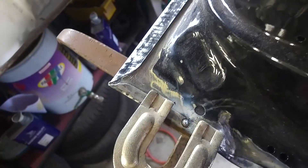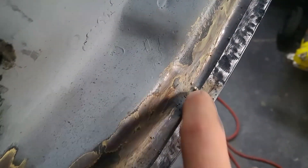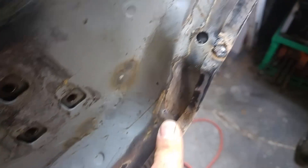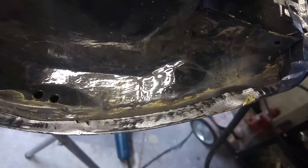I'm clamping a piece of copper backing to wick some of the heat out. The clamp will prevent the skin from opening up if it gets hot and wants to move. This one's a bit heavy and lumpy but we're going to move forward — I've probably gone a bit heavy on the welding, but that will clean up nicely.